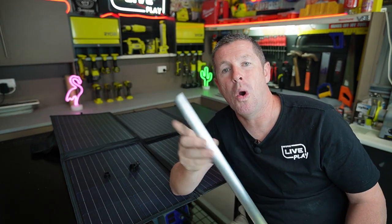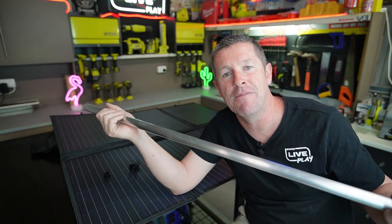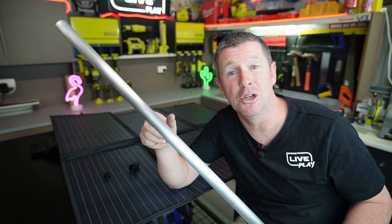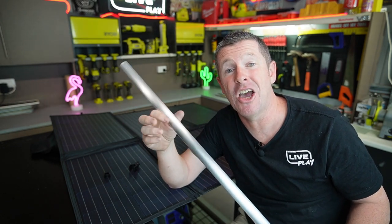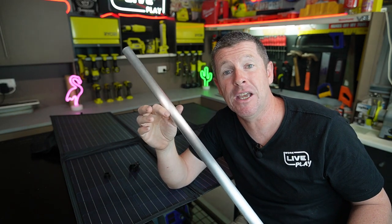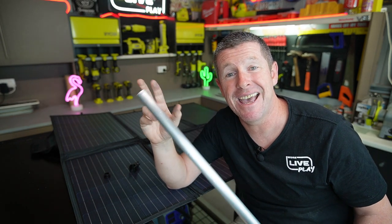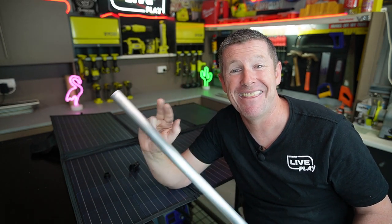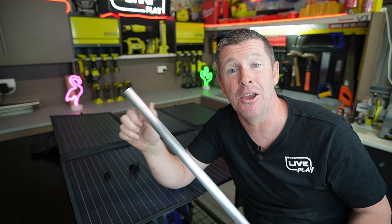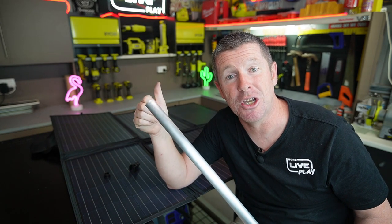The 25 mil 1.6 wall tube I got from my local metal supplier and it came in a 6.5 meter length. I got two lengths cut at 2200 so they fit in the back of the van. That 6.5 meter length only cost me $35, which was probably cheaper than buying four one-meter lengths from Bunnings. Definitely go to your metal reseller — they can cut it down. It was only 21 cents per cut, so I probably should have just got it all chopped while I was there.